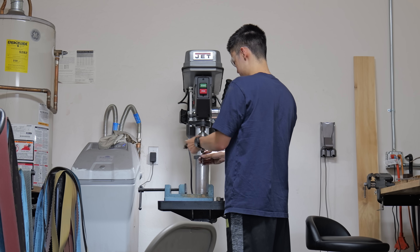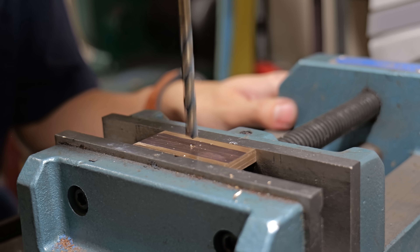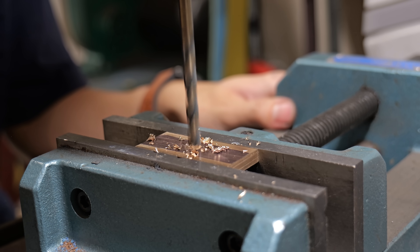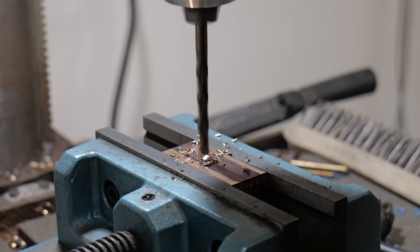The thickness of my tang is around 0.3 inches flat, so I go to my drill press, slap on a quarter-inch drill bit, and start drilling my holes. As I'm drilling these holes, all I can think of is all the filing I have to do later to get this fit up to the tang.